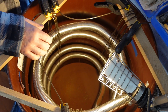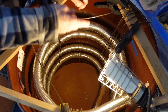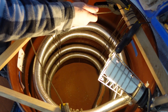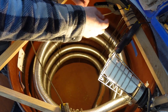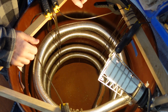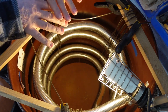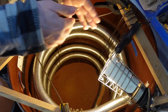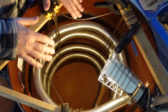The other thing I've done is set the coils six inches apart using this washing line — it's one continuous loop. I don't want to cut it because I'll get into trouble, so I won't know if this works until it's too late. When it's full of sand, my idea is that because it's thin it'll sneak past the sand, but I might have to chop it and do it each section. Anyway, I'm going to put the bricks in now and start building this up. There's about five in the bottom and then two and two and two to form a central column, then we'll push the sand in around it as we go.